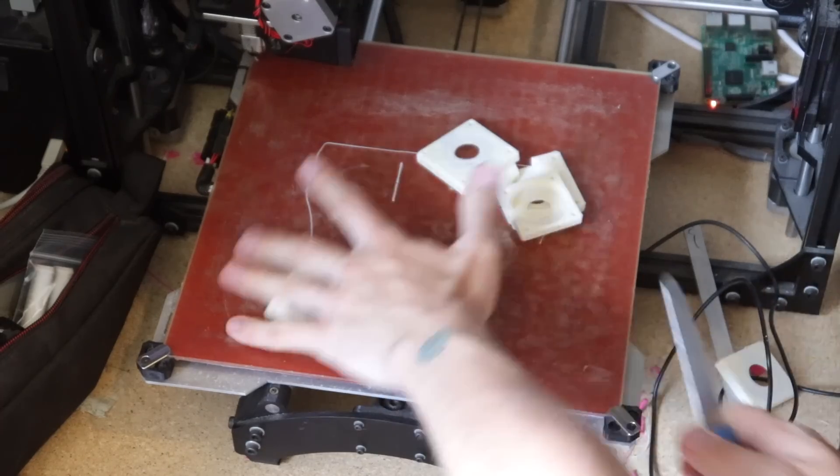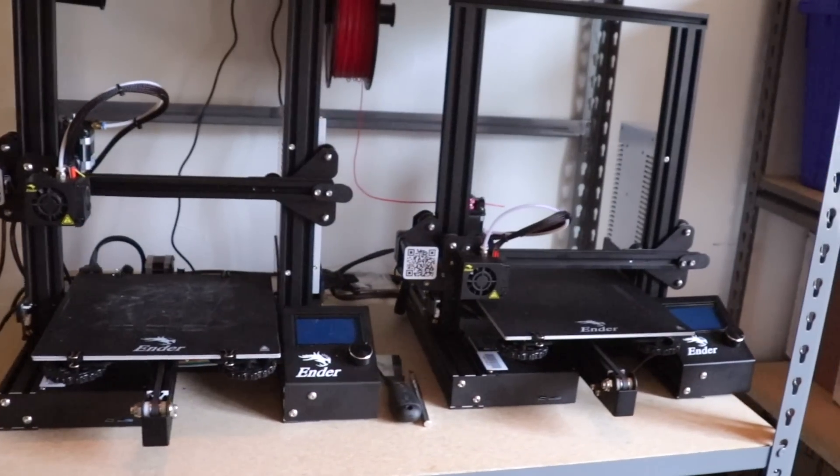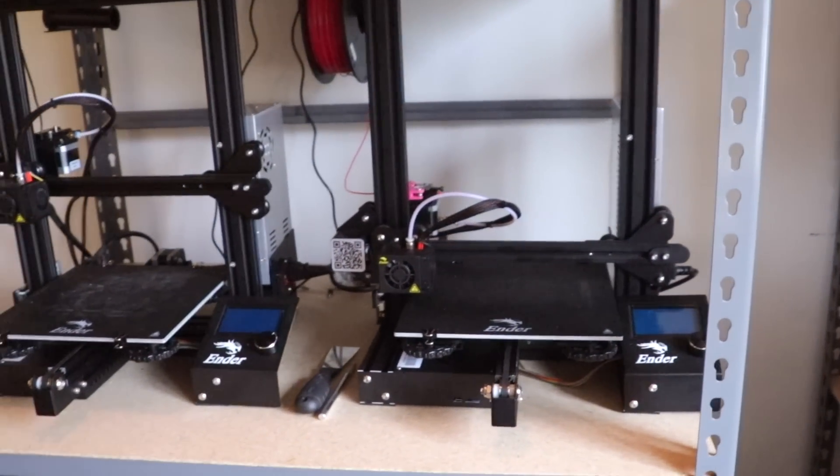This is where I've been producing all the parts for three machines over the past few weeks. I have spent many a long hour in here trying to debug these Ender 3's. I originally bought them because I'd heard so many good things online about how reliable they are and how with a few modifications they put out really good quality parts. I have had nothing but bad luck with these so far — they worked pretty well at first, but after a while they started under-extruding and skipping steps on the extrusion motor, even grinding through the filament. There are a lot of things you can do to try and fix this: I printed an adapter to convert to direct drive, I have adapters coming to replace the PTFE tubing fittings, and I've heard tensioning the idler helps too. But it didn't work out too well for me.